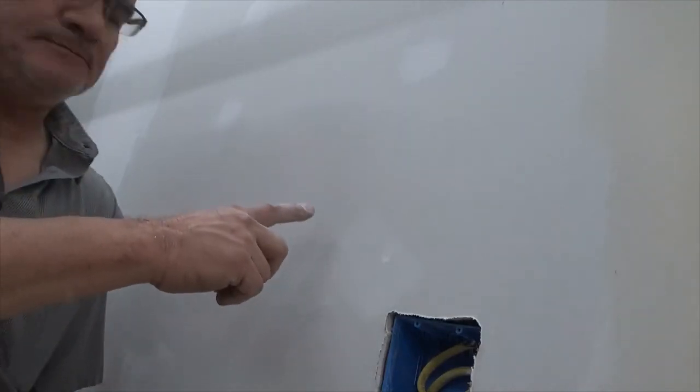Now the nails, I don't know how well you can see that. Let's see if I can tighten it up. Okay, so you one-coat the nails in the joint compound. That's the other thing about joint compound, it shrinks. So you go over your nails the first time and cover them with something like this. You do this kind of action and then you wipe it off tight.